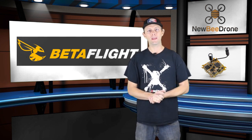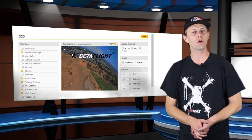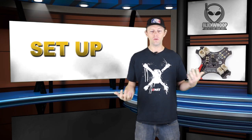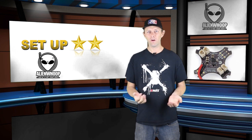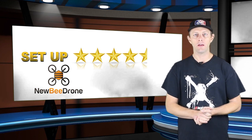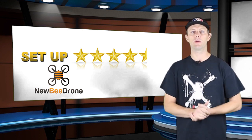The Newbie Drone B-Brain Lite uses Betaflight — basically plug it into your computer and set all the parameters. You can also turn on and off OSD display and RGB LED lights, which you won't find on the Alien Whoop. Since the B-Brain Lite does not require any soldering, it's a great entry-level drone for kids and those without a lot of electrical knowledge. For ease of build, I'm giving the Project Zero a 2-star rating — the directions on their website are still confusing and their videos aren't streamlined. Newbie Drone gets a 4.5-star rating for the B-Brain Lite thanks to its plug-and-play design and great tutorial videos online.